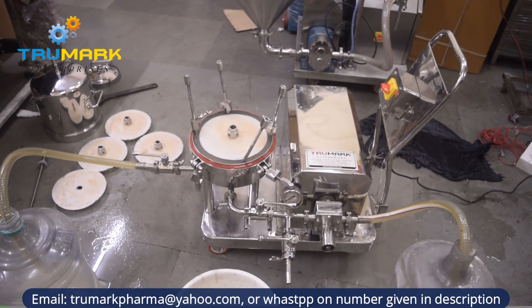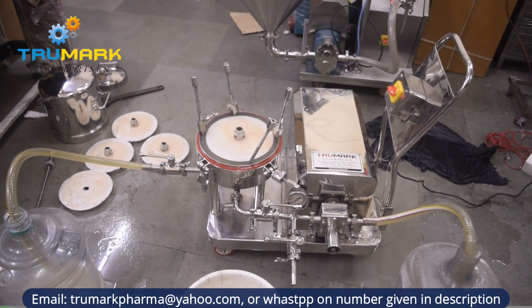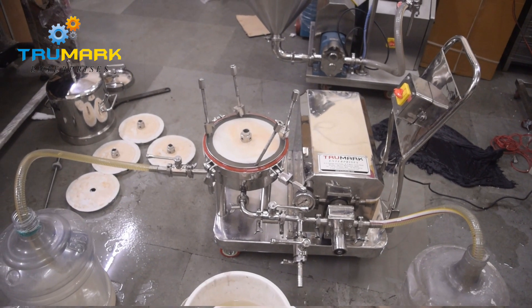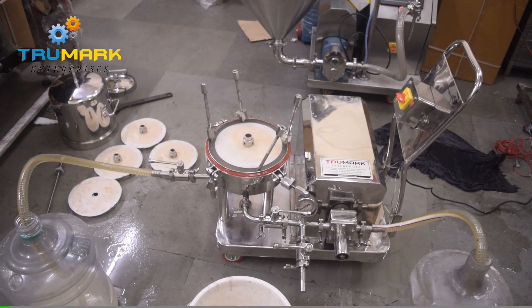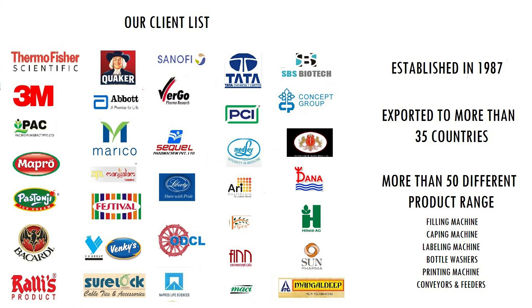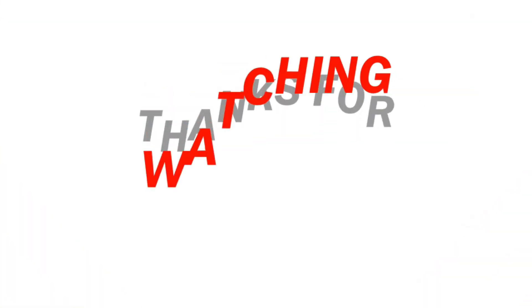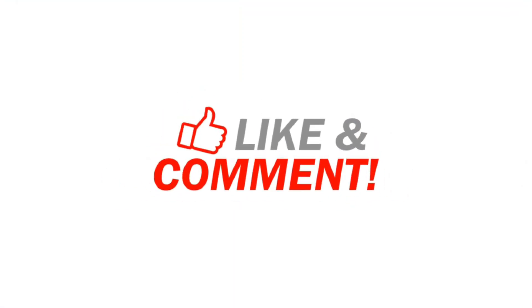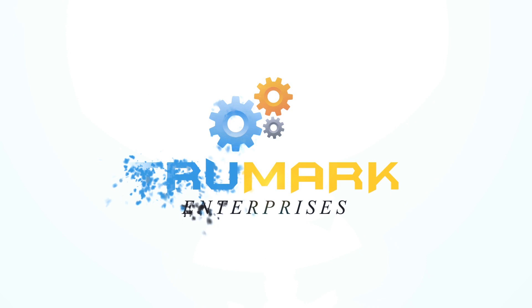This was all the process we need to do with the machine to filter the product — like sugar syrup, juices, chemicals, or any kind of liquid which has oils, sediments, or particles. It depends on which micron size pad you need, based on your product and the particle size you want to filter. If you have any further questions, kindly get back to us on our email ID mentioned below the video, or the WhatsApp number given in the description. Send us your inquiry with complete details: what product you want to filter, how many liters per hour, and what micron size. If you are not sure of the micron size, we can offer you different size filter pads to do trial batches, or you can send your product for lab testing to know the particle size. Thank you for watching — please subscribe to our channel to get more updates.